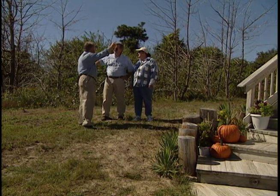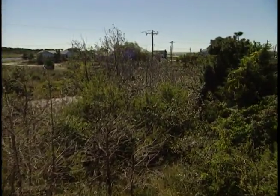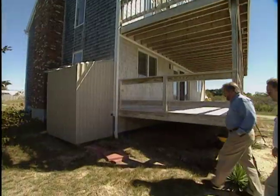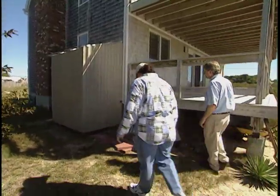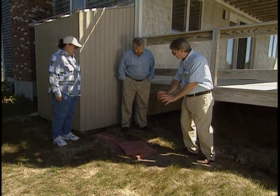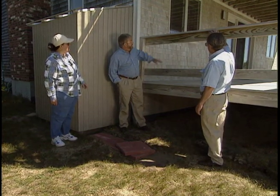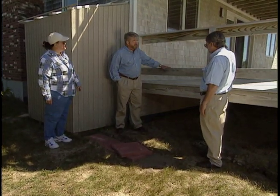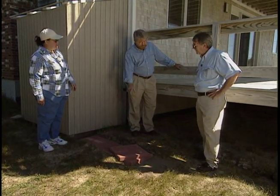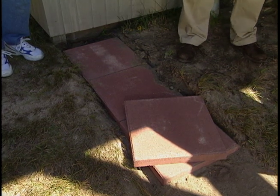Hi Ron, we're just getting ready for you. Can we see the ocean from up here? I want to go up there and get a view a little bit later on. You built this house yourself? Yes, we did. So the stairs are going to go right down here to this landing. I'm going to put a four by four post here and one here, and we want to tie that into this area with this post. Instead of pouring concrete down here, you decided to put these pavers in on sand, which you've got plenty of here in the cape.